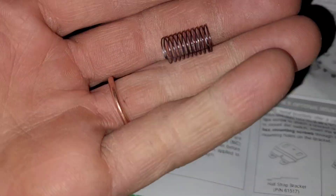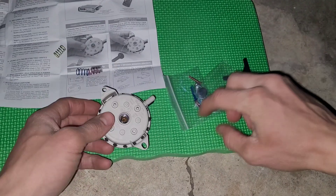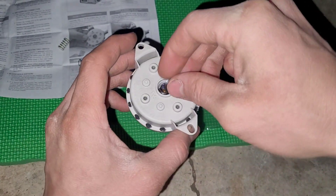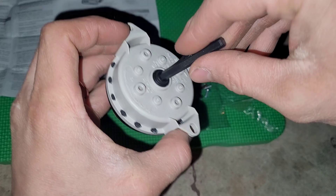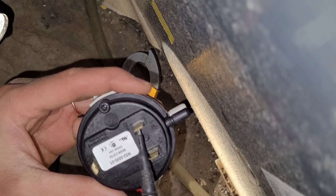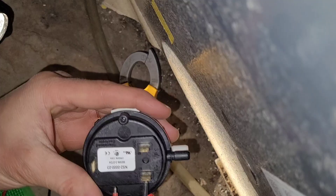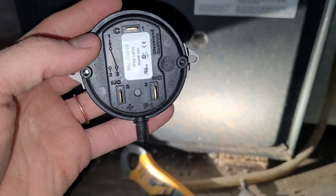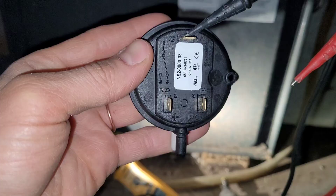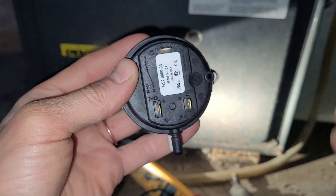Take the black spring and lay it into the back of the switch. Then take the plug and the allen key, get it started. You can see this is the normally closed position and this is the normally open position. The instructions say it starts in the normally open position, and you tighten it down until it switches. With that tightened down, the normally closed contact is now closed and the normally open is open — that's our baseline for adjustment.